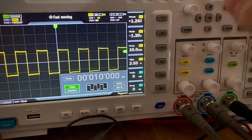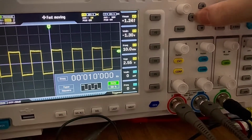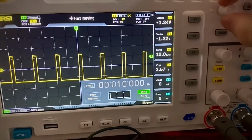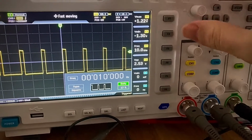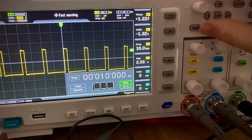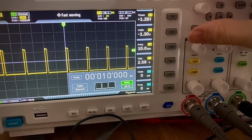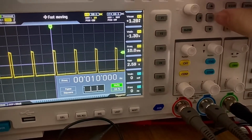That's the part that's really confusing. You click OK, then change to duty. Then you can change to 10%. Ooh, it automatically updates, right? Because it's generating inline, you have to be ready for that in your circuit. If your circuit for some reason triggers on whatever, just remember that it's real time as you change. I'm a software developer, so for me it's weird to change without confirming, but fine.